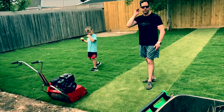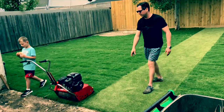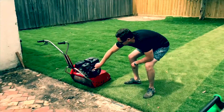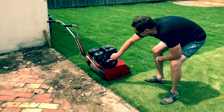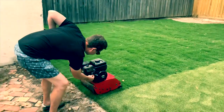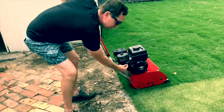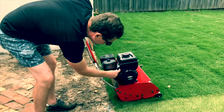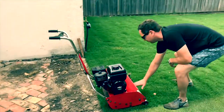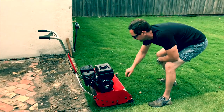We're just going to fire up the Rover 45, get it running and do some cutting. We've got the new Briggs 3.5 horsepower on the side there. Just flick the on switch, make sure the fuel is on — which it is, as I did a mow this morning. Put the clutch to about halfway. I want to have the revs at about halfway and ensure that the reel is currently disengaged from the clutch — which it is.